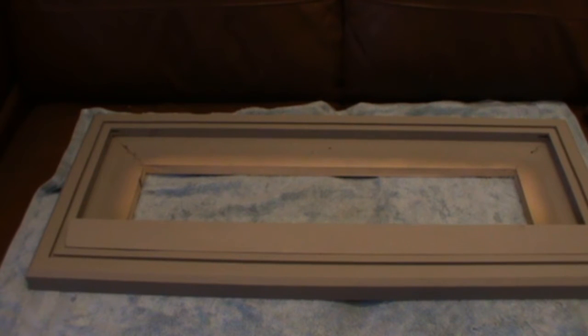I've given the stand three coats of primer and that has actually brought out a few other imperfections. So what I'm going to need to do is go back in with the wood filler, fill in those imperfections, give it a light sanding down, then give it a final layer of primer, followed by a good wet sanding, then clean it all off and put the black paint on top. Hopefully I should be able to achieve that today.